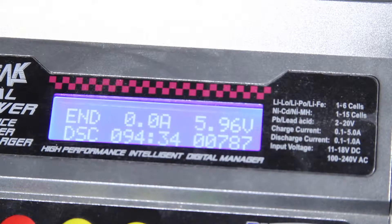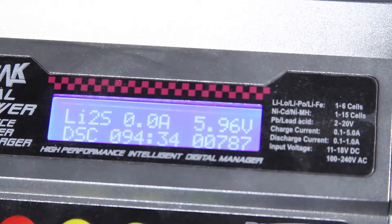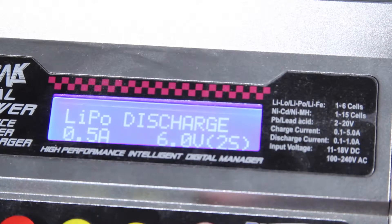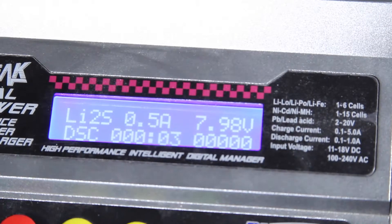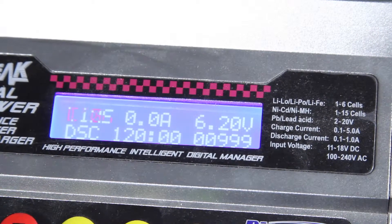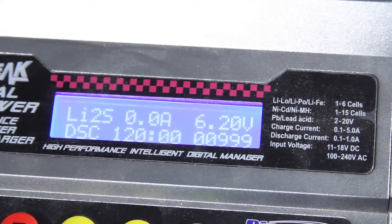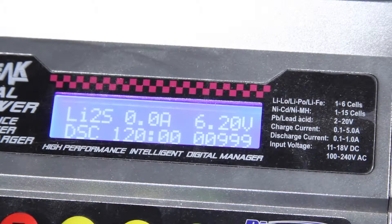Let's check the Canon battery and see how it performs. I'll disconnect the Wasabi Power battery and install the Canon one. Start again — same thing: half amp, cut off at 6 volts. A couple hours have passed, and I forgot that my charger/discharger has a timer cutoff for discharge mode. So as you can see it's been 120 minutes — 2 hours — and it's pulled out just under a thousand milliamp hours. We're down to 6.2 volts, so it's pretty close to drained. But I'm going to restart it, and we'll need to add this 999 to the number we get at the end.